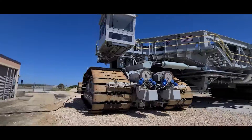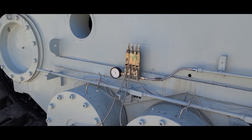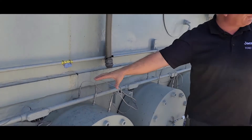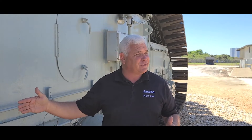As we're on the trip, we're monitoring pressures. We've got grease injectors being monitored and thermocouples — four per traction roller assembly, including one on the inside. With the grease we're using, we really don't see any difference in temperature even under load, believe it or not. The only temperature difference we see is whether the sun is shining on one side or the other.